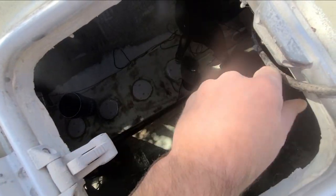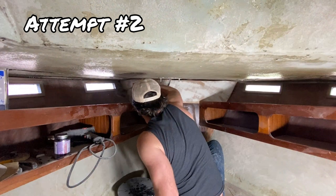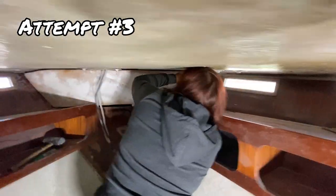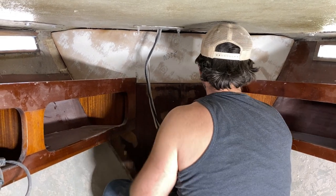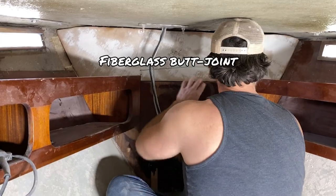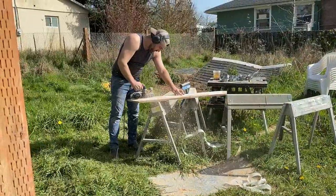These little humps need to come off. Juice me. Thank you. Whoa, Hercules. Now we can put our strip like this. Yeah. So it holds the two together, and then we'll put one across the other side the entire way. Chris then used the planer to get that perfect inlay for the joint. Meanwhile, now using some acetone to wipe down and prep so we can tab in this bulkhead.